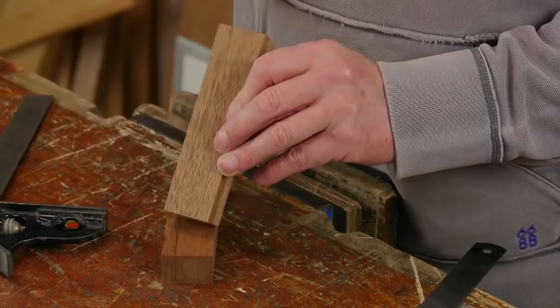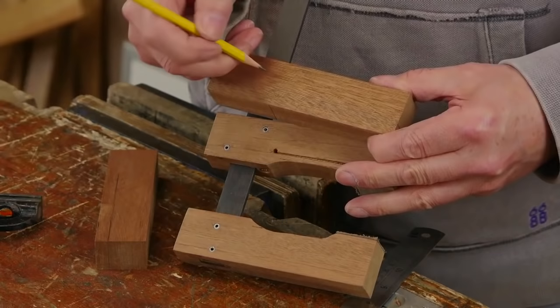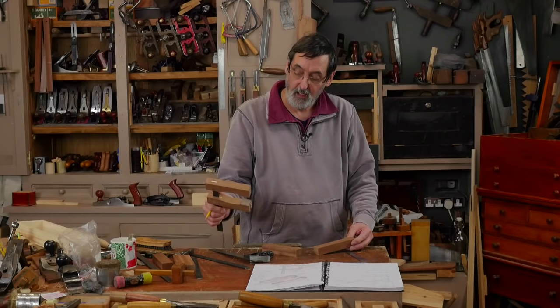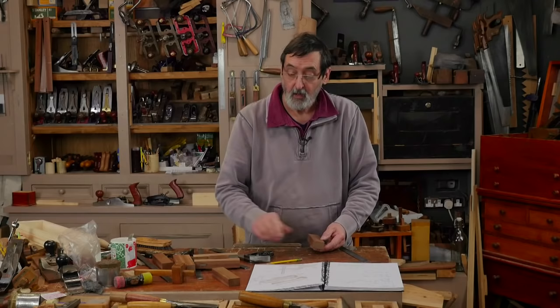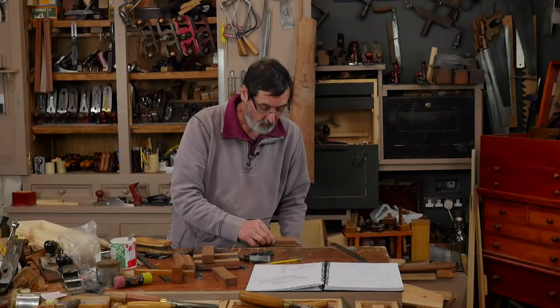This is this part here. Let's see. Can you see how this now corresponds to this part here? So right on this inside corner here, I want a 4 millimeter hole to go all the way through, on the moving piece only, on the slide piece only. Let's put this one aside for now. This will do my second piece on the other. So I'm going to replace this because this doesn't have this split down here. Should have noticed that. I'm going to put the hole through here first.